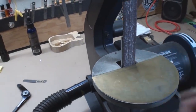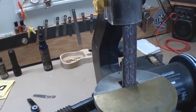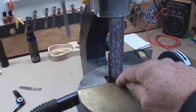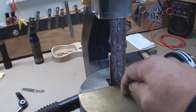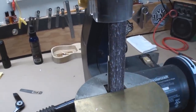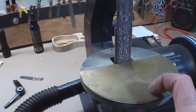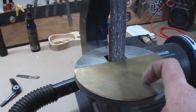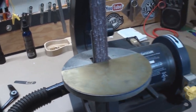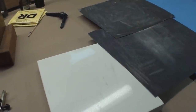Okay, so what I've also done to this little belt sander — which I don't think I paid $60 for, ever — I mean it is a piece of hobby equipment, but the gap between the belt and the deck is really wide and it really never accommodated doing what I just did because the saddle would just fly down that hole. So I did the same thing on both sides — that's just some brass hobby-shop sheet with super-skinny double-sided tape taped into position. What a concept — make your own tools!